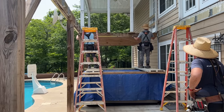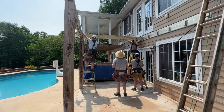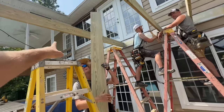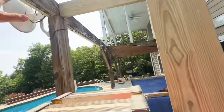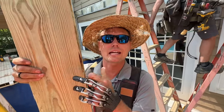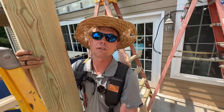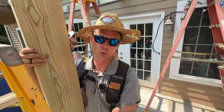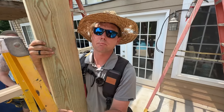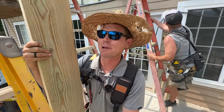We need to see what we're shooting for - 115 and a quarter. We're putting up new joists finally, and I want to ask Jamie if they're flushing out on top sitting in these hangers. Surprisingly they are coming pretty darn close - if anything I'm having to space them up in the hanger a touch, which only means the original wood we pulled out was really fat when it was wet and new. John is going to tweak out the bottom of the hangers a little bit to dress it up - basically hit it really hard from the bottom and smash it up.